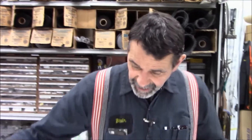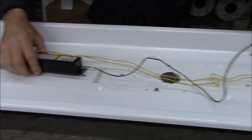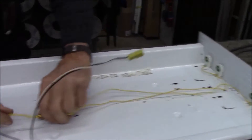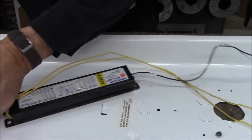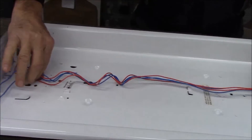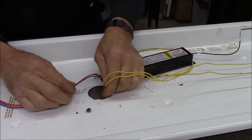Here we're going to give you a quick example of how easy this is. We have a light fixture with a ballast that's already been pre-wired. All these tombstones are wired together — if we connect these wires, we send the white all the way down so all tombstones get the white. We take this side and send the black or hot wire to all these tombstones. All we have to do is put all these together with a wire nut and connect to the black, then put all these together with a wire nut and connect to the white — you'll see how easy this job really is.